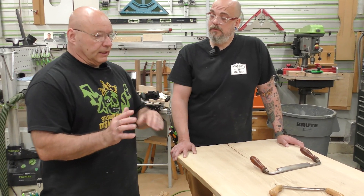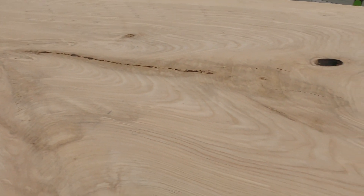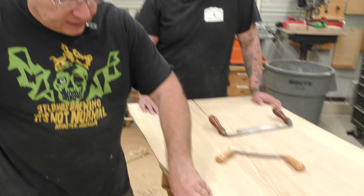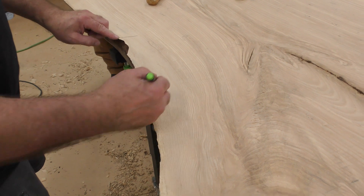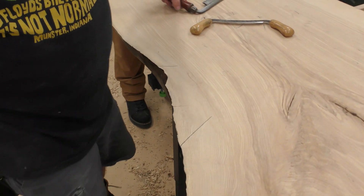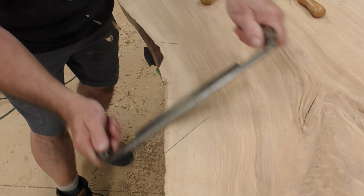When we look at the bottom of the table, we don't want any knife edges because you could hit your thighs with them. I'm going to slowly fair those, but not as extensively as the top was rounded over. We also have to attack this cracked area — I'll take it to about here and remove that section. I'll take a draw knife and slowly remove it, then soften the edges.